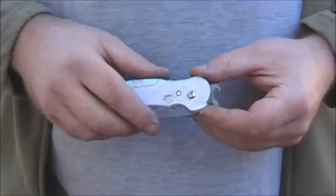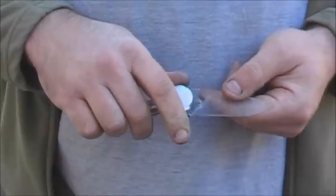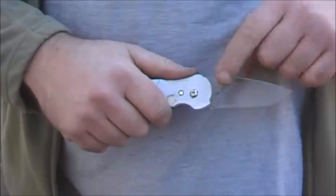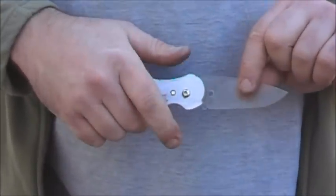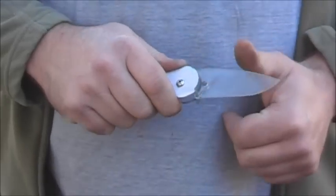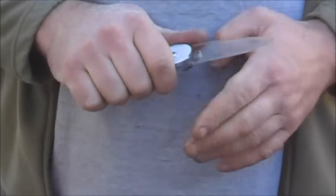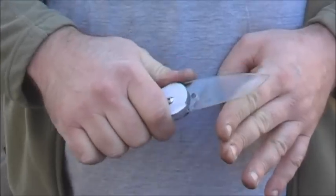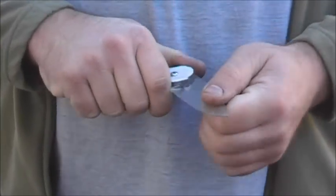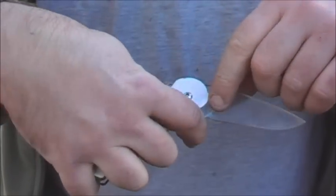This one's a model made from Perspex — you can flick it open. As you can see now, there's no choil here. The blade starts straight, and I've had to move the thumb ramp back beyond the pivot point, so that when you're cutting and holding here, the finger choil is now here — it's pushing into your thumb on most grips. When you're cutting away you don't really need it. Boring is when you're probably going to have a problem, but in general, even when this folds, the finger is actually fairly safe because it hits a ricasso part.